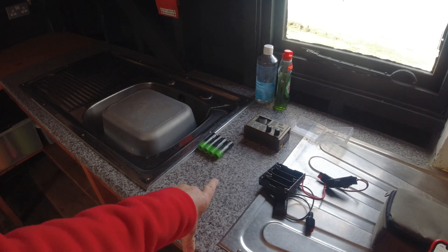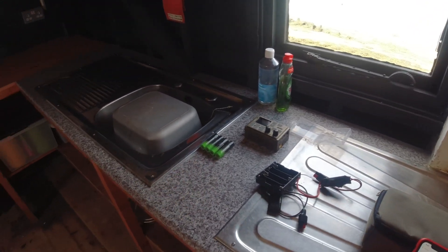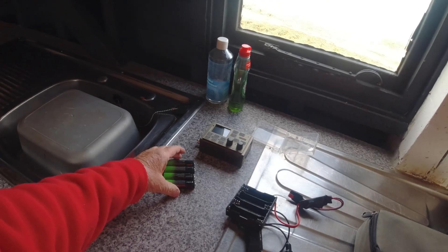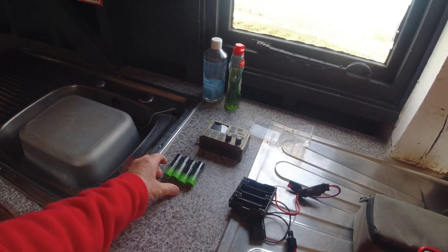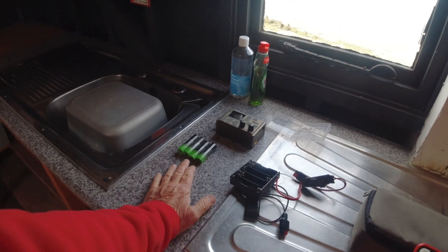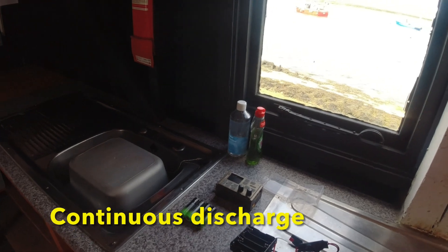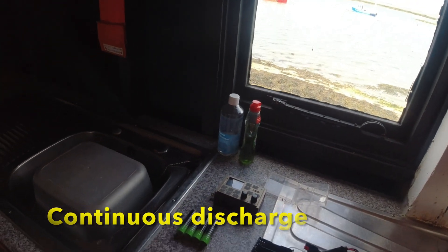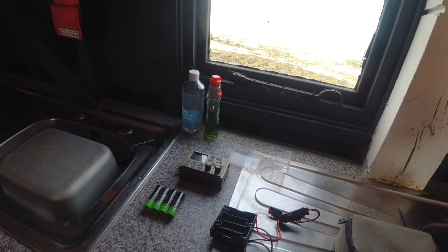Their websites are quite good sources of information on these batteries. Both dealers batch-test them to make sure they're meeting the correct specification. I'm going to order some from a reliable source - probably 10 amp, or at least 8 amp, to match the maximum current draw of the G90 which is 8 amps, so a little bit of leeway there.